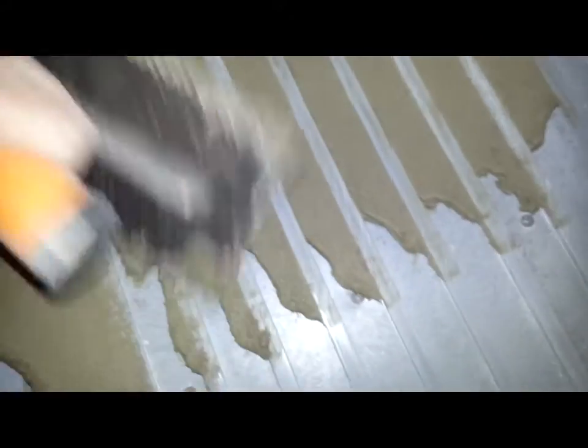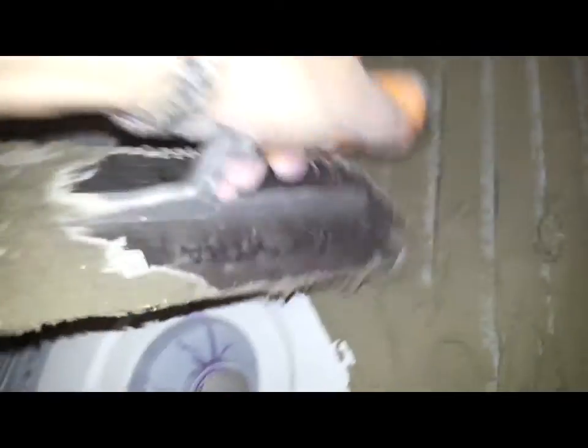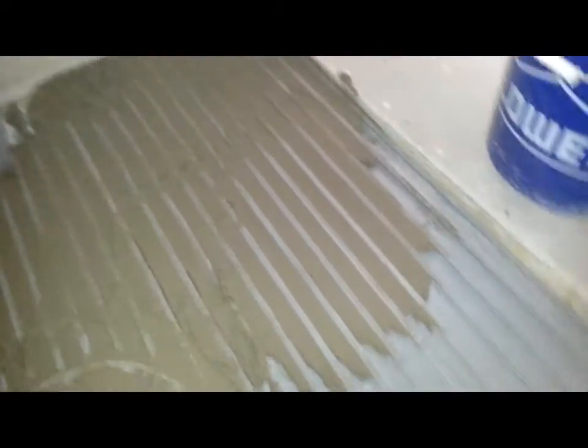At this stage we're taking the thinset and pushing it down into all those little keyways and just screeding it off. We force the thinset down between the drain and the TI Pro Board and work that in well. That'll give us a nice connection between the TI Pro Board and the drain. The next step is we'll screed from this level here to the level up there with the 4-in-1 floor mud. While this thinset is still wet, that'll bond to the 4-in-1 floor mud and we'll get a really good connection — a very strong floor — ending up with a slab that's only fairly thin at the outside edge.